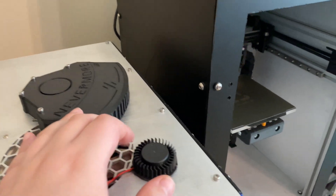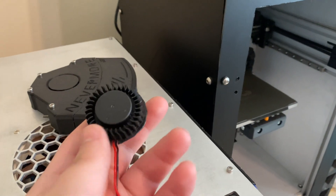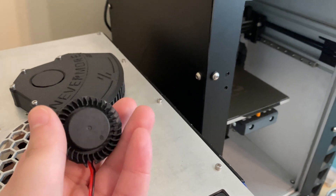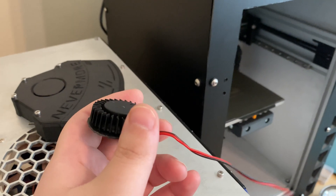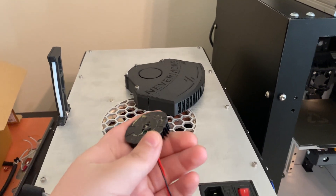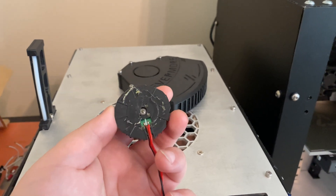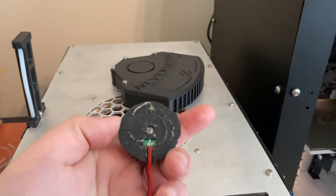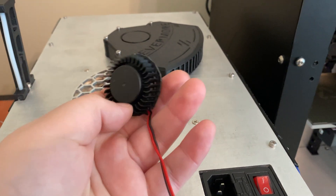I turned on the printer, did the Klipper configuration for the Nevermore Micro, and connected the fan. I turned the fan on and realized it wasn't turning — I didn't hear any noises, and there was no airflow I could feel near it. I opened the Nevermore Micro with the fan still on, and then after about 10 seconds a horrible smell started coming from the fan. I'm pretty sure it was magic smoke. I turned off the printer before I triggered the smoke alarm. I think this was a 12-volt fan and I connected it to 24 volts — there's no label on it so I can only guess. I definitely don't want to risk using this fan again.